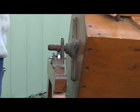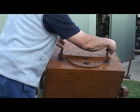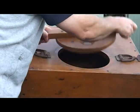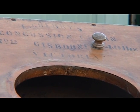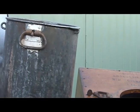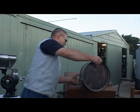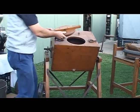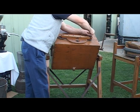This is a small industrial churn — it's called a concussion churn, made by Cherry and Sons Gisborne in Victoria. It's a number two and it makes 40 pounds of butter. You take the lid off and you pass your cream can through a steamer first to loosen the cream up and make it liquid again, because cream sets very quickly when it's allowed to stand for a prolonged period of time. You pour your cream in, then put the lid back on and make sure it's firmly fastened, otherwise you'll lose it as you spin it.